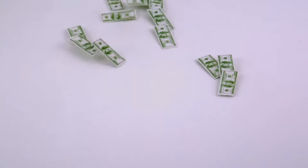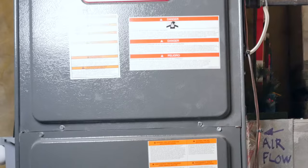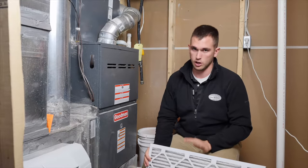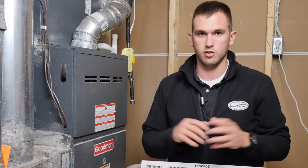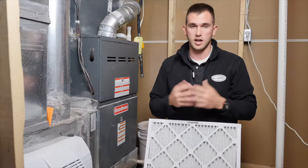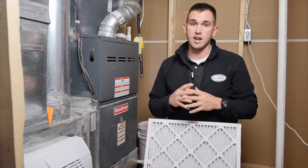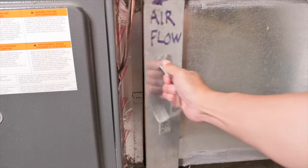It's going to really cut down the life of the system and, in the end, more than likely cost you money. In fact, changing the filter and choosing the right one can save you money. All of our homes are supplied with a Goodman product. What the manufacturer recommends is really a lower-end filter — the basic inexpensive filter with the accordion-style mesh overlay. The reason we don't want to use a hypoallergenic or high-level filter is that they clog very quickly. If you forget to change your filter, you are really laboring the system and causing it harm.